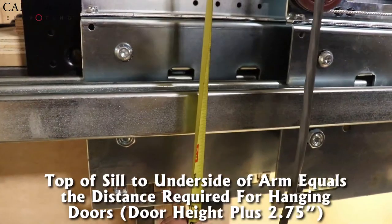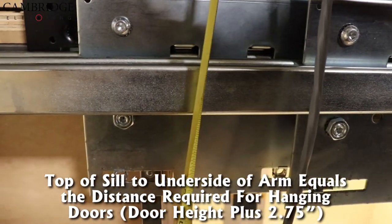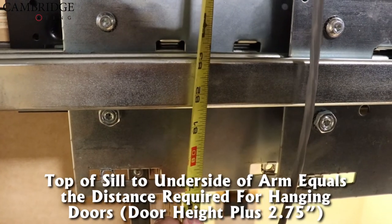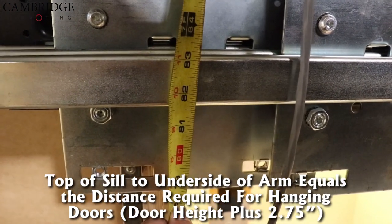As you'll see there are some three-quarter inch shims on the rooftop — that's only going to be for your combination of 84-inch cab with 78 and three-quarter inch doors. Now we need to set the height to mount them. Take a measurement from the sill to the underside of the arm, plus two and three-quarter inches, for a total of 81 and a half inches — that will be the correct height for your doors. Drop the tape back on the top of the sill and confirm we are at 81 and a half.